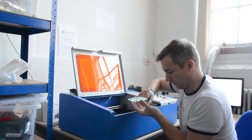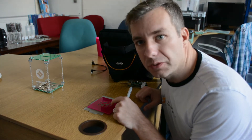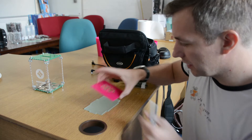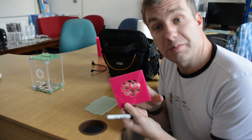And some leftovers. I'm gonna prepare the next print which is gonna be the top and the back, and in the meantime while this is being carved out we're gonna make some holes for ventilation. The back is already done. I didn't want to do any holes on the laser cutter mostly because I'm not sure where they're gonna be and I'm gonna cover it up with a Raspberry Pi logo. The idea is to make a hole inside the front plate and that's gonna be intake just to make sure the Raspberry is properly cooled and cover it up with a Raspberry Pi logo on the standoffs. So the air can be intake from the side and you shouldn't be able to see any holes at all. So what I'm going to do — previously I've cut out this part of a Raspberry. I'm gonna nicely align it, mark the holes, make the holes a little bit bigger and then create the standoffs outside to which the Raspberry Pi piece is going to be attached to. So let's do this!